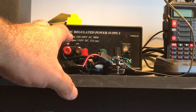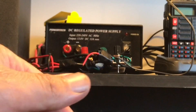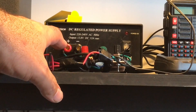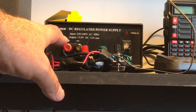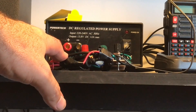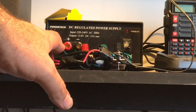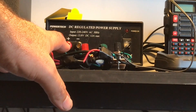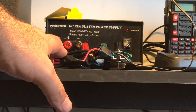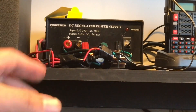This is my current shack power supply — a switch-mode power supply that was very noisy. There's a video in the ham playlist below showing how I applied a simple filtering circuit and then the Drew Diamond filtering circuit, which filters both on the mains and on the output. Drew's design was a step above what I did and improved things greatly, but it's still not perfect.